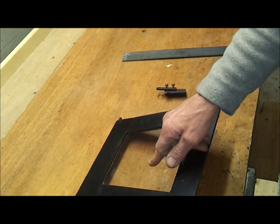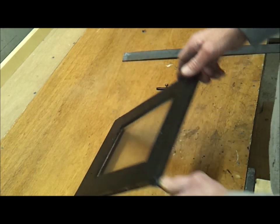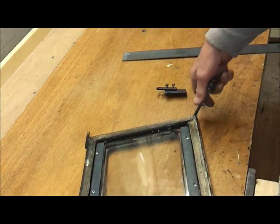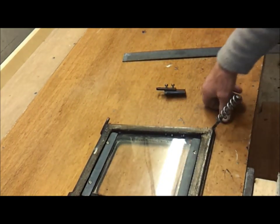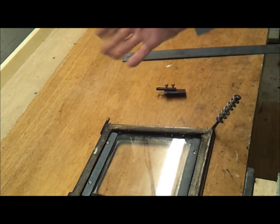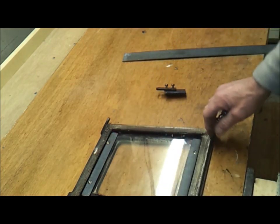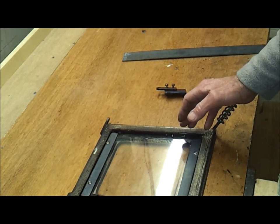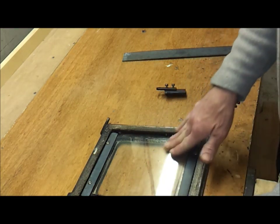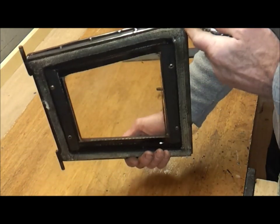Another thing I was going to say was, if you're having trouble with your glass sooting up on any stove, really, if you get some caustic soda crystals and dissolve them in water, cold water preferably, about, say, a tablespoon in a pint, put it in one of them little squirty bottle things, and you can use it to just spray on the glass, leave it on for say 30 seconds, a minute, and it'll take all the tar, all the soot, everything off the glass. It's fantastic, it cleans glass up really well. And that's it. I think that should cover it all, Don.